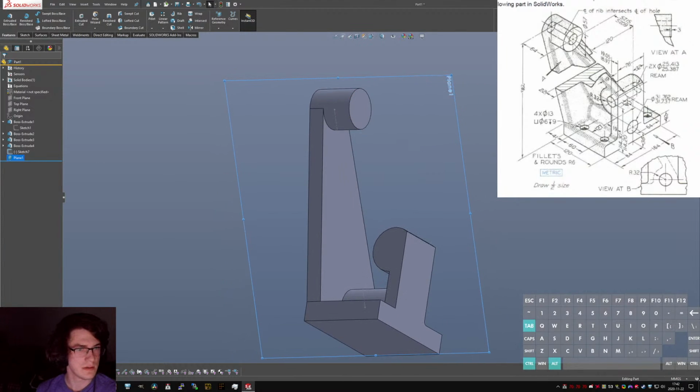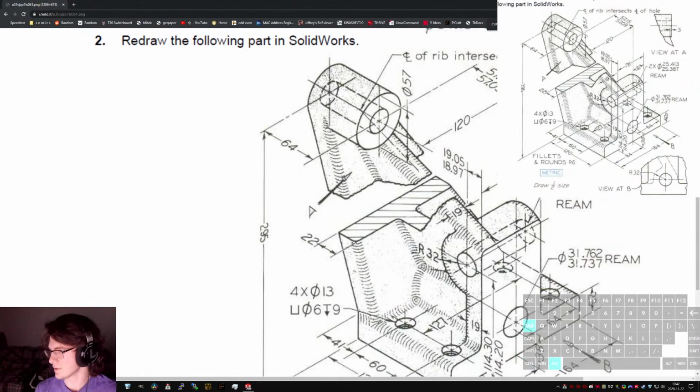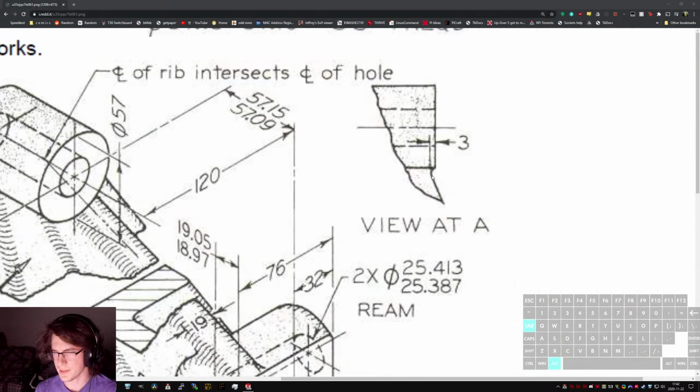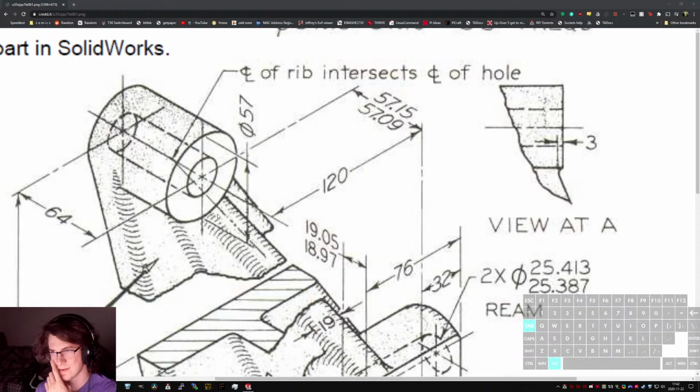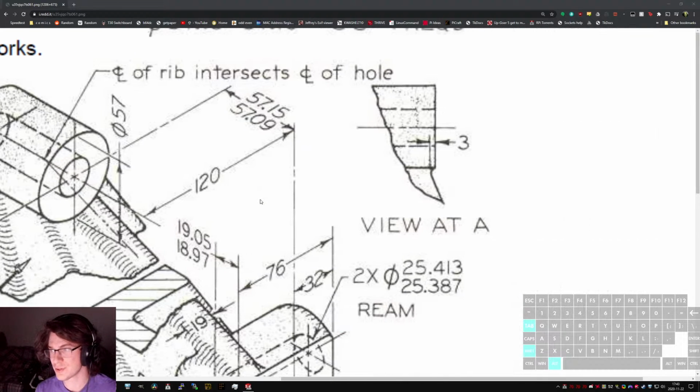The hell? Okay, so I'm going to bring up the drawing again, just because it's really... I'll hide the other drawing. So right up here, this doesn't make any sense. It doesn't at all. That 3mm radius fillet doesn't make any sense there, because right under here it has to make a weird undercut. And that fillet has to go between those two faces, so that's a physically impossible fillet. You can't design that way. You couldn't draw that in SolidWorks.